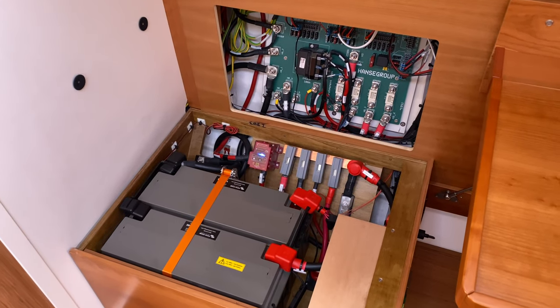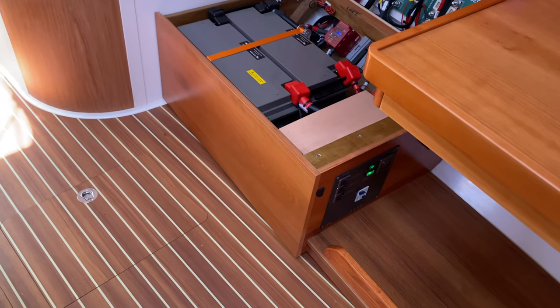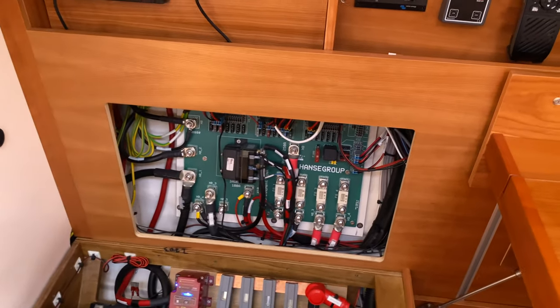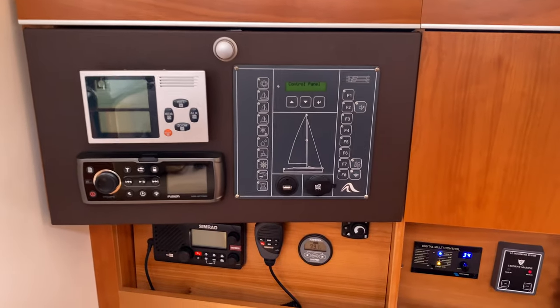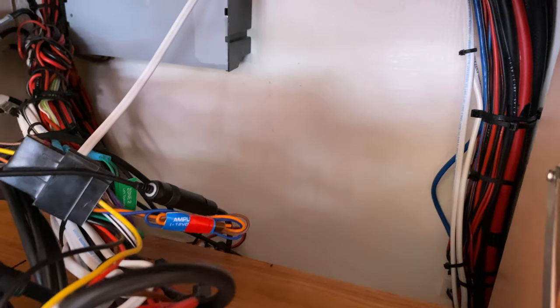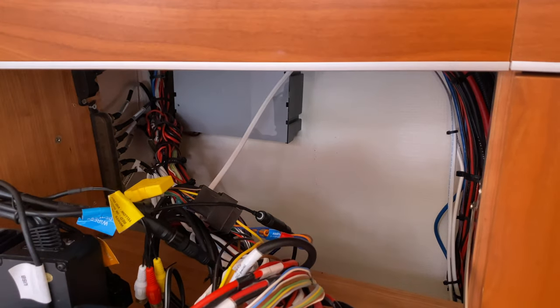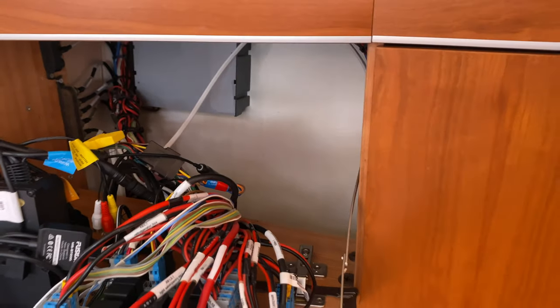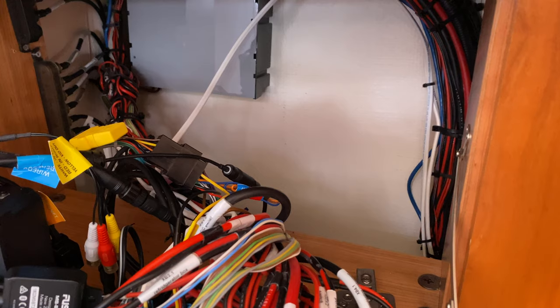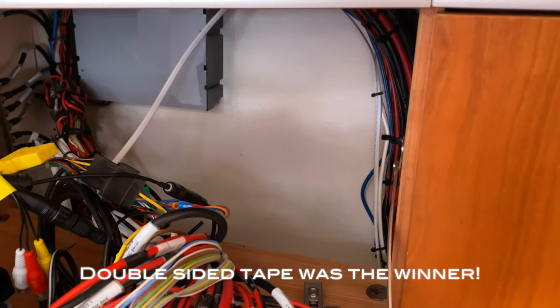This is my electrical area on the boat. Down here is the battery bank, and the DC panel is over here on the side - this is kind of the handsome motherboard. And up here is the AC panel. Behind the panel I have a little bit of space, and I think that is where I'm going to install the controllers. I bought just a length of PVC door casing - it's waterproof and fairly thin - and I'll attach the pieces of PVC to the side of the hull and then screw the controllers into the PVC.